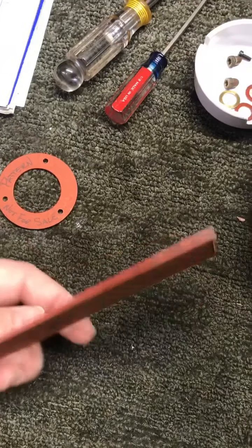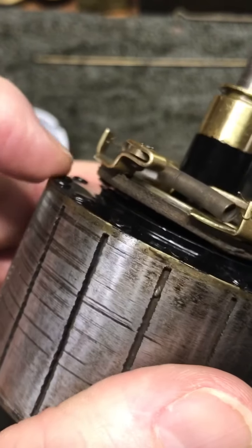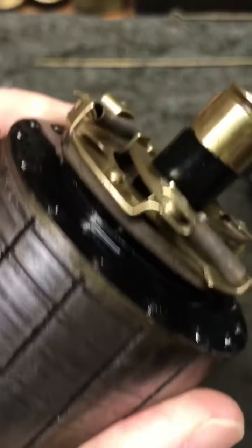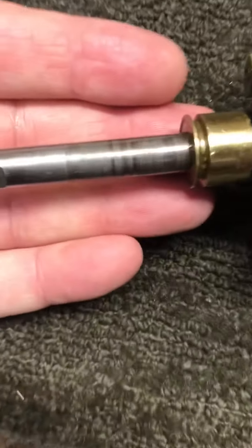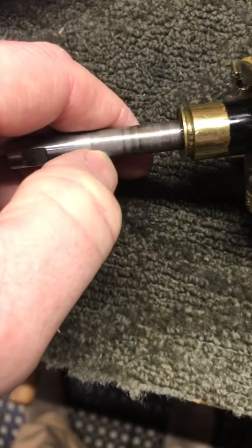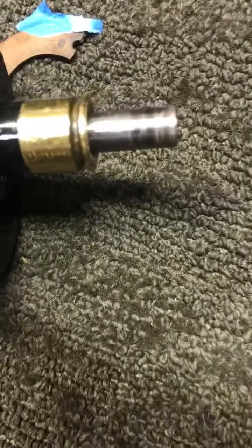This fiberboard is getting a little harder and harder to find, but I'll make a couple of these insulators to go in between there — they're supposed to insulate this from coming in contact with the rotor. We'll make some of those insulators, and might have to work on this rotor shaft a little bit. Let's see if I can turn it around here and get it to focus — we've got some grooving in the shaft here, front side and back side. We'll see if we can clean that up a little bit.